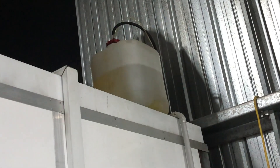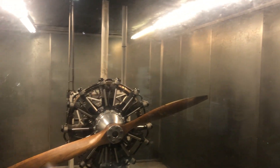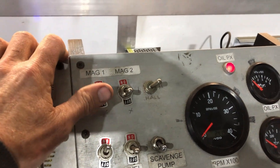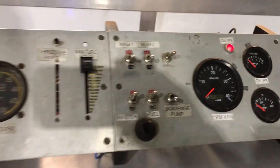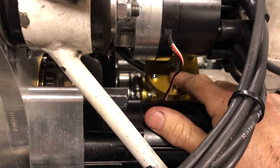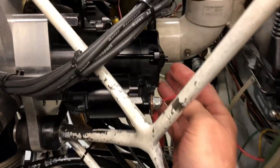All right, let's give it a run. So we're outside the booth now and we're ready to run. Got plenty of fuel up there that goes to an electric pump through the test stand, down one of those conduits there, and then to the mechanical pump on the engine. First thing I'll do is switch the master on and turn the fuel pump on. I'm going to open the throttle and then I'll come in here — I haven't got a primer mechanism set up from the panel — so I'm just going to physically reach in to the TBI and press that button until I can see — looking through my phone — some fuel dribble on the floor. There we go, that's good. There's actually a little hole drilled in that 90-degree fitting so it drains that out, so it's plenty of fuel.